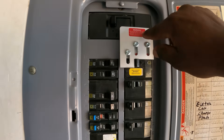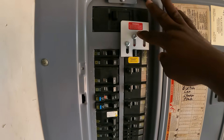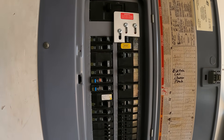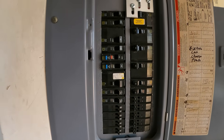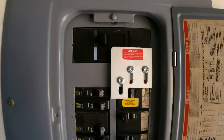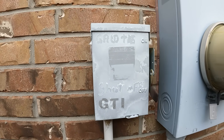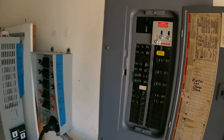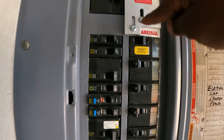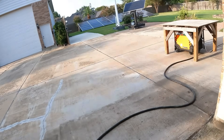My main is off. I come to my lockout, turn on my inlet box. Inside the house I've turned off most of the main appliances — fridge and everything. The only things that will come on are two ceiling fans. One more thing I do before running the generator: I turn off the grid side to my solar panel, so the solar panel is off. Main is off, solar panel is off, everything is disconnected from the grid. Now I turn on the lockout — power is on.